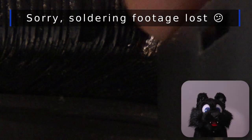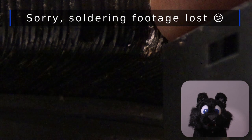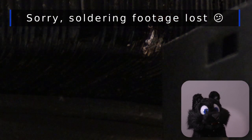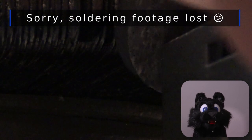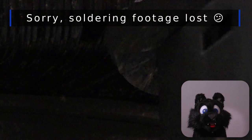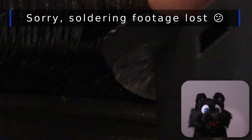You might want to check yours too. I took out the soldering iron and added a bit of tin on the scuffed wires, just to increase the current capabilities — the damaged section does have a slightly reduced diameter after all. I did scrape out any solder between the windings and covered the spot with some lacquer.